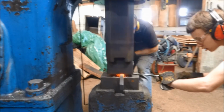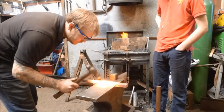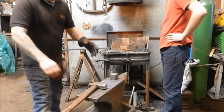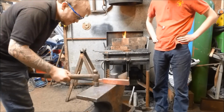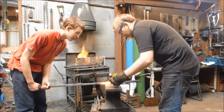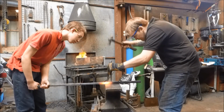It allows me the ability to work more efficiently, and also being able to have the guillotine tool, for example, is a good example of a generic tool that allows me to work more effectively. You'll see later when we come to punch the bigger holes that the generic tooling isn't so necessary there. I had to make an actual piece of tooling for this job. That costs money, it takes time. So in all, you have to remember those elements when you're costing for these sorts of jobs.